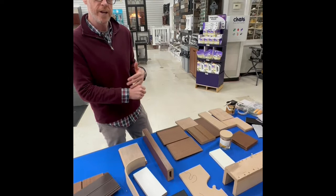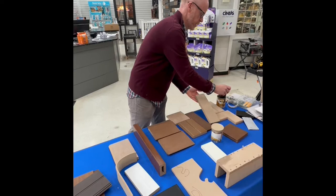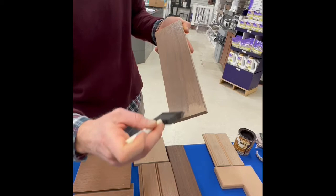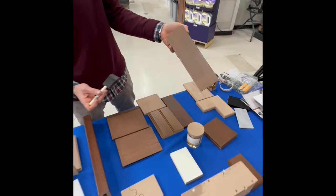The features and benefits of Acre are that it's incredibly stiff when manufactured. It's sanded to create a mechanical profile that will actually take paints and stains without primer, super well and super strong in the field. I can display it right here — a water-based stain easily applies to a trim board, and it adheres right to that surface. The rice husks allow that stain to sit nice and well right on that trim board.